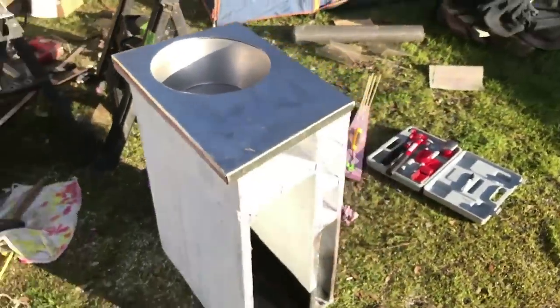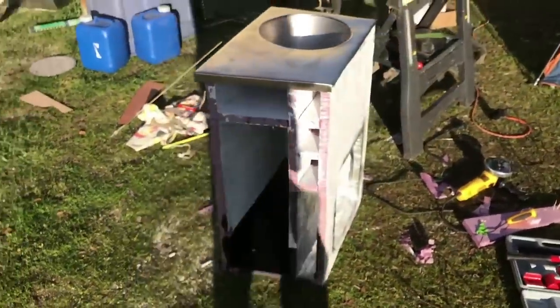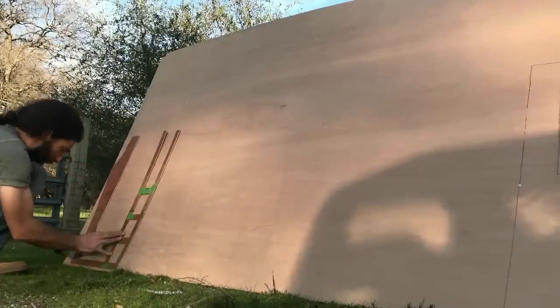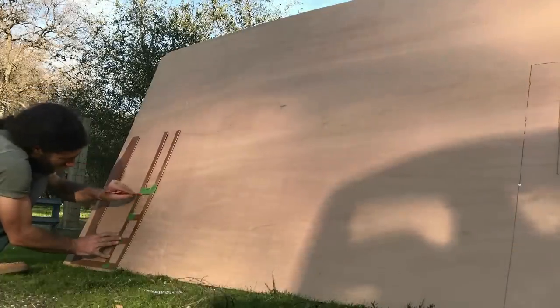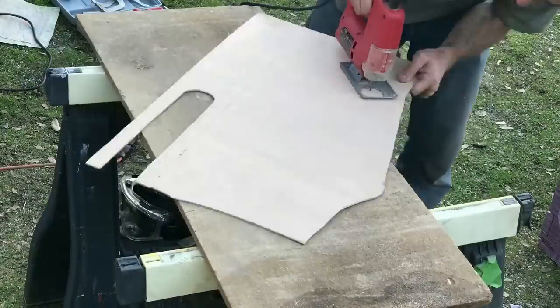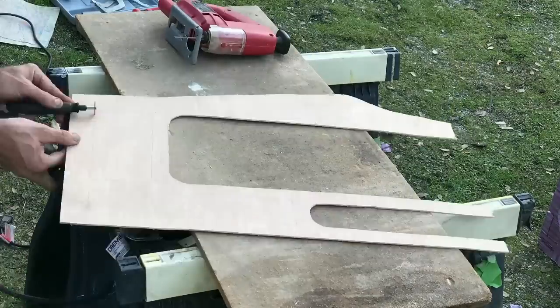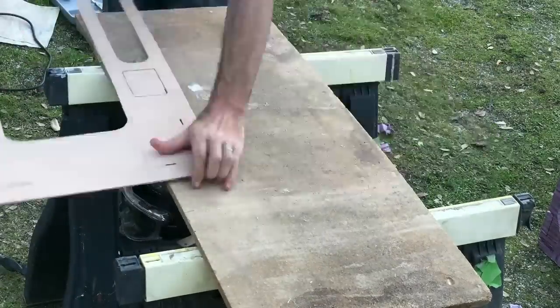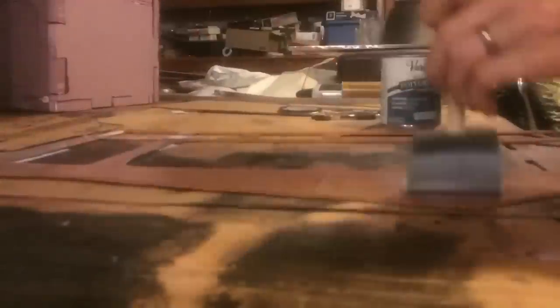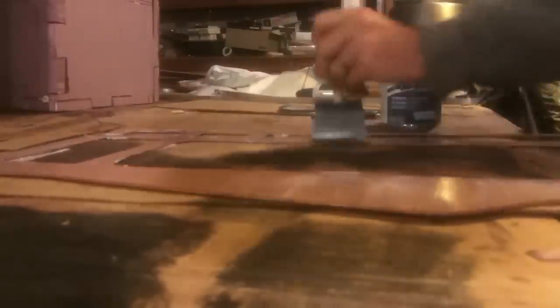The next thing is to get some wood laminate on the outside. We're going to trace it out of one-eighth inch finish-grade plywood, then cut it out using the jigsaw. I'm saving all of these door pieces because I'm going to use them for my door and drawer fronts later on. We're going to stain those to bring out the grain, then use some polyurethane to protect them from scratches and dents and give them a little more sheen.